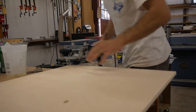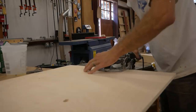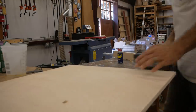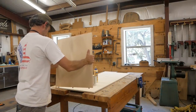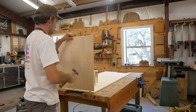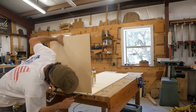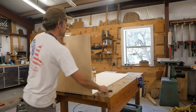I've already cut out the sides and the parts for these boxes, and I'm using my Festool Domino to create basically a joint to glue these boxes together. This is all half-inch birch plywood. The Domino strengthens it and makes it much easier to assemble the box. Be sure to use glue here because I want to make sure I'm making this as strong as possible. It's going to be an RV, it's going to bounce down the road.